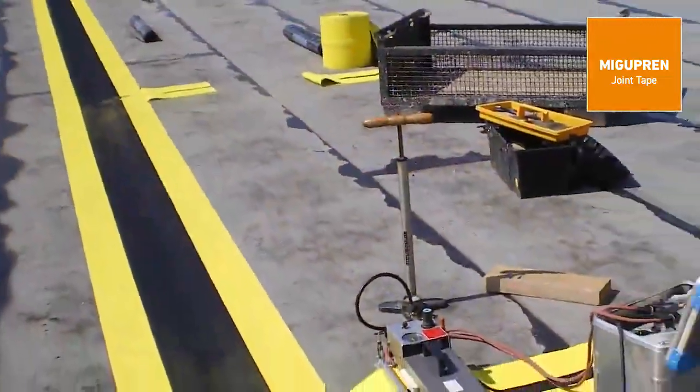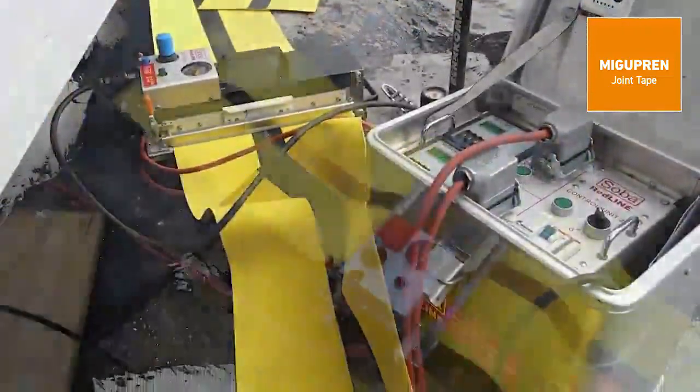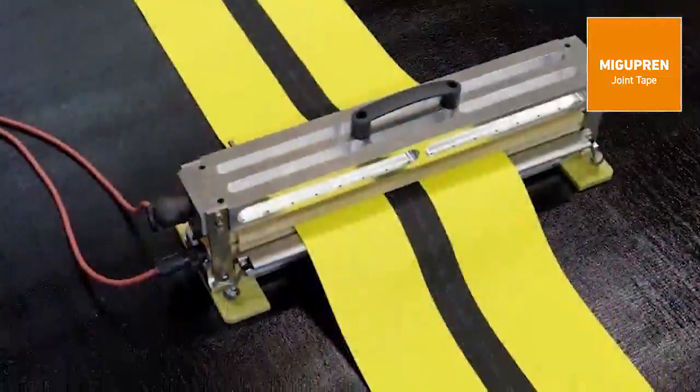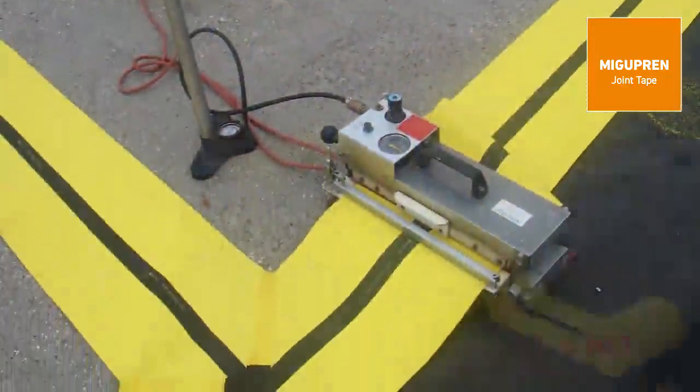There are many installation situations where a pre-assembly is not or only partially possible. In this case, the individual sections are spliced, fitting and tight, using the specially developed mobile vulcanizing device by the action of heat and pressure.